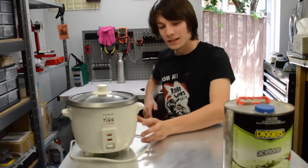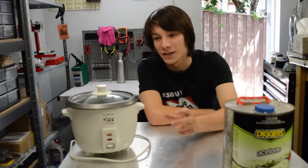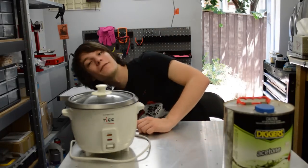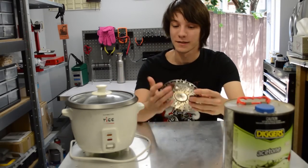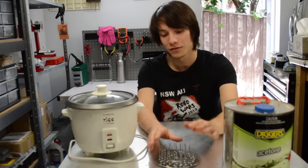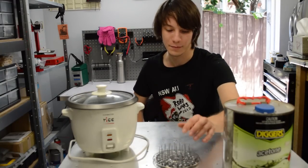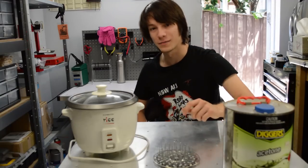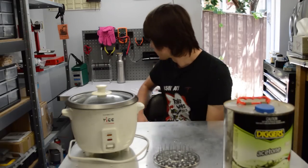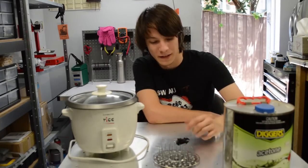Something often overlooked with acetone vapor smoothing is that the parts will be really sticky and tacky after the process. You need to hold them in place but not touch them afterwards for about an hour. The best way to do this is using a jig. The best jig I've found uses a steamer base with the sides removed, with rivets to create a pin bed. This holds the 3D printed parts in place with only a few points of contact in the vapor bath. Otherwise touching more places will cause melting and a bad surface finish.